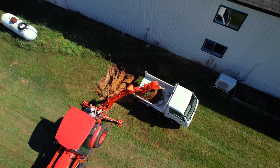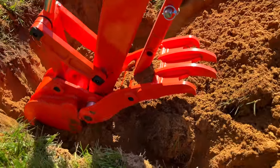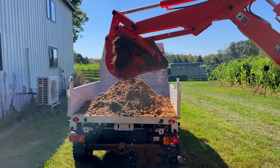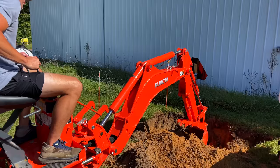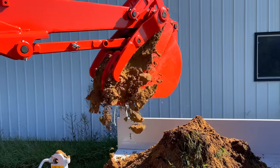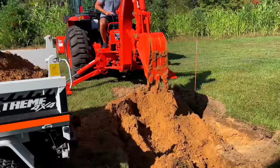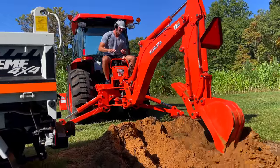That anode bag is not good for the life of the tank — they have to test those periodically. Every three years they have to test them, and depending on soil conditions, sandy soil will probably burn it up a little bit faster. The bag will sit at the base of the tank. If it ever has to be replaced, they'll just auger a hole with a post hole digger and plant a new bag next to it. That's why they show up every three years, just like they do for the house tanks.